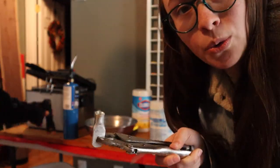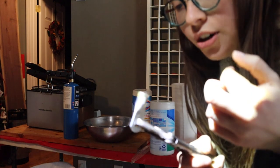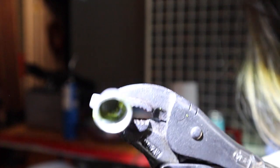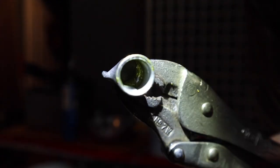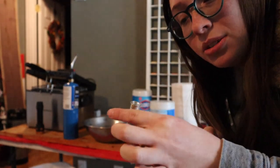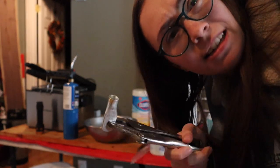We just dunked it in cold water. When the solder was solidified we can dunk it completely and then pour the water out and the solder stays. That yellowy stuff is the solder and it's solidified. Now since we dunked it in cold water we can handle the wire lug so Jacob can put the wire in safely without burning his fingers.